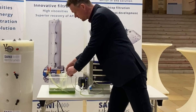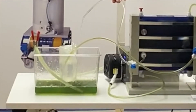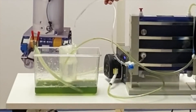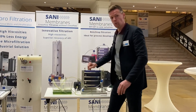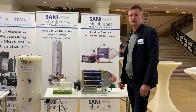As you can see here, even though we run with a pressure lower than 0.1 bar, we have a very high flux, and this is for all the systems that we offer on membranes. So even though we run with around 0.1 bar, we have a high flux, no product shear, and very little fouling. And this is actually what vibrofiltration can do.